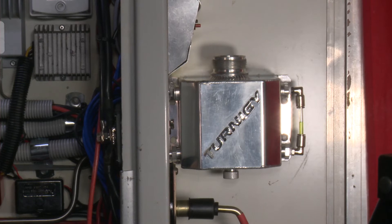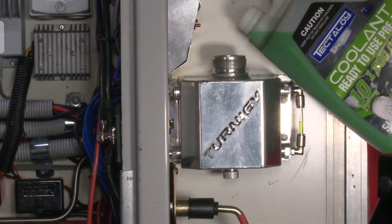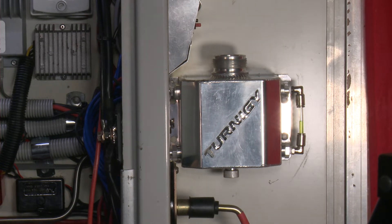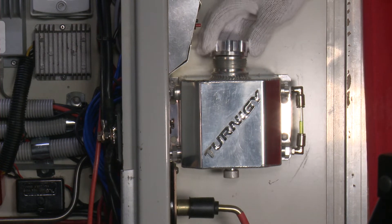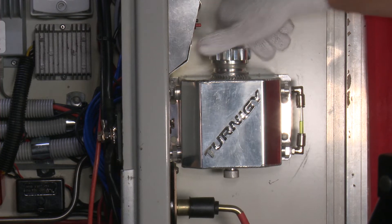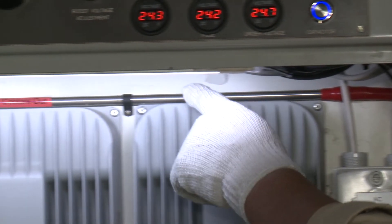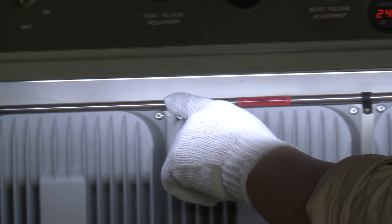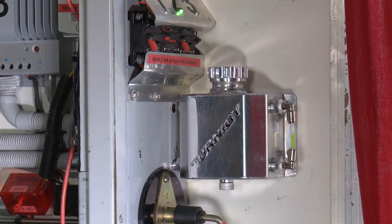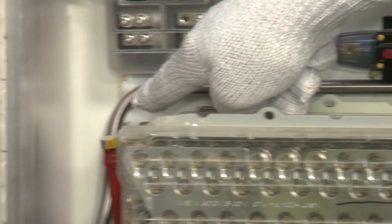I may be criticized for installing this liquid cooling system, but why not? They were plumbed for it from the beginning. I felt if I ever had to overload it, it may help protect the batteries, as they were very expensive for me in Australia. Liquid coolant is cycled from this alloy header tank through this stainless steel pipe and connected to a DC pump, then pumped back to the header tank. When the pump is turned off there is a natural thermosyphon action.